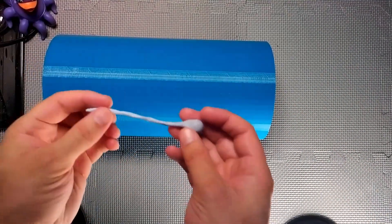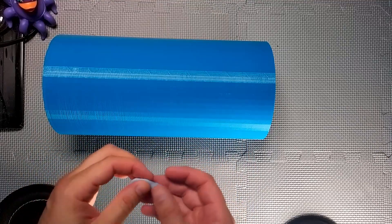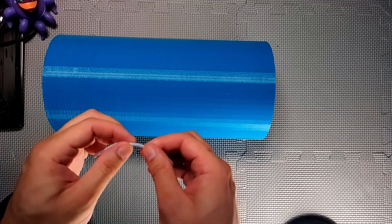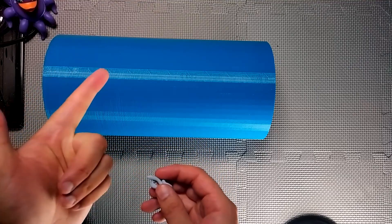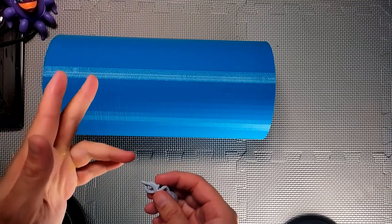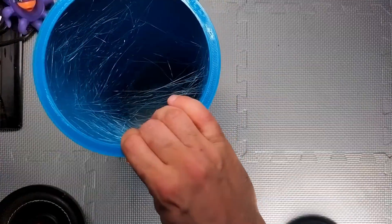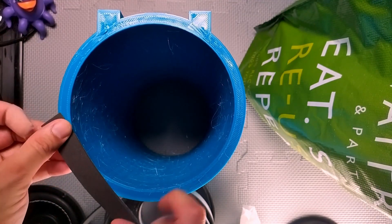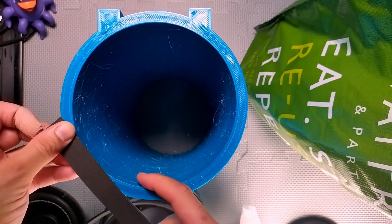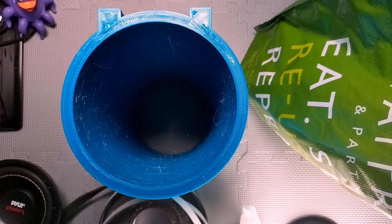Okay so now I need to put these together and do some measuring. Initially for the passive radiator I'm going to use good old Blu-Tac. I'm hoping to be able to use the Blu-Tac and then measure it with the Dayton Audio DATS, and that will give me the resonance — hopefully a resonance for the driver and a resonance for the passive radiator. So I'm going to cover the top part of this with foam to help provide the best seal between the sub driver and the enclosure.